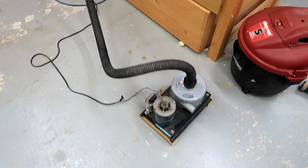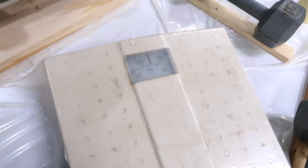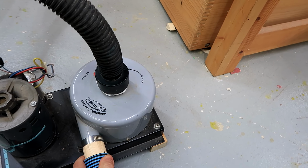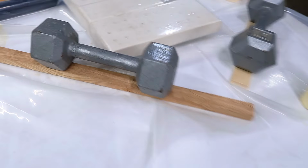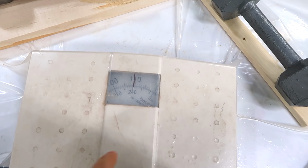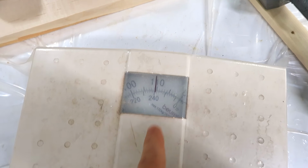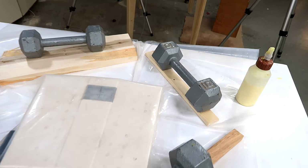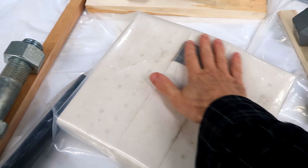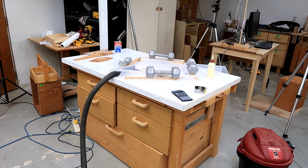And with this blower that's much quieter, I get almost as much. And now for extra suction, I'm going to put the hose from the vacuum on here and turn that on. So this has gone almost all the way around. 110 kilograms, 240 pounds. So that's effectively 24 of these 10-pound barbells stacked onto every area of this size. I think that will do. Between those two, I'm sucking about 1/8 of an atmosphere.